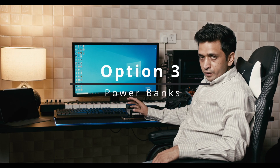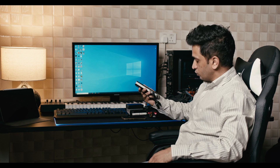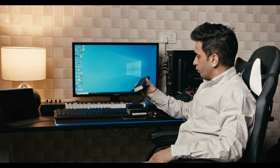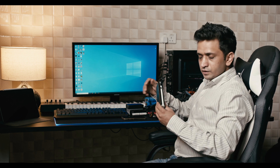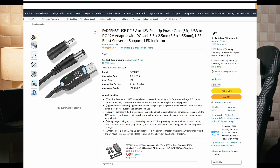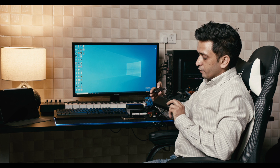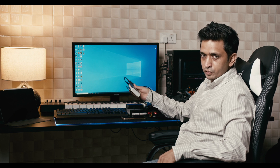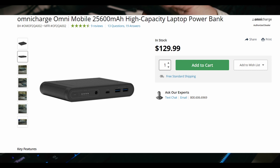The next power option for the location audio kit is power banks. These days you can find several DC power banks that give power through USB-C or DC output, ranging from 12 to 18 volts. There are also power converters that work with normal power banks, boosting from 5V to 12V. Some converters only go up to 8.4V, which is not enough for all mixers — most require 9 to 12 volts minimum. A good power bank can cost around $100.